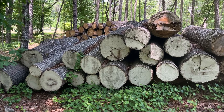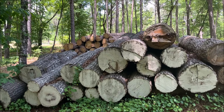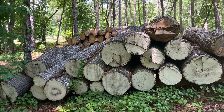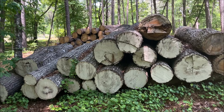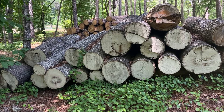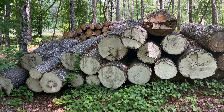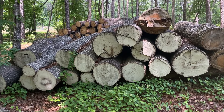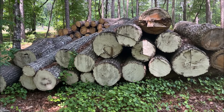Here's what I have queued up for this year. Most of it is oak. The pile on the other side is pine, which is going to be used mostly for construction projects. The oak ends have been painted — I used latex paint, going with materials on hand. I know I could buy products specifically for that at a higher cost, but the oak log that's in the kiln right now was coated with latex paint on the end and had no checking at the end of the six months drying time. I just need a place to store the wood. I'm going to set up a couple of places on the property, slab this oak for the most part, and air dry it for as much as a year, and then finish it in the kiln.